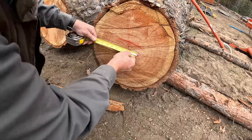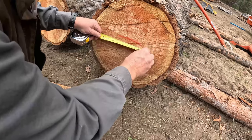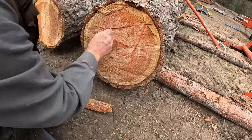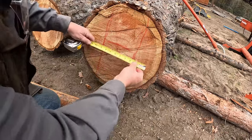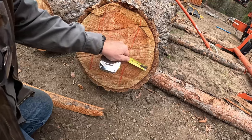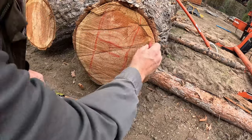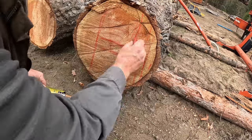So we're gonna cut that, and we're gonna cut 6 inches, with 3 being at the center. So we want to cut there and there. So our 6-inch cant has to come down here like so. Okay. Now what that means is I can then come out here and figure there's a 2-inch board. That's not gonna make a 2-inch board, but I can make a 1-inch board. So I'm gonna wanna take this off right here. Then I can take a 1-inch board here, a 2-inch here.